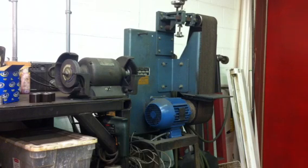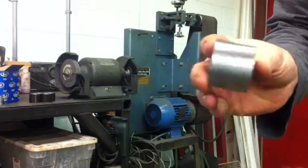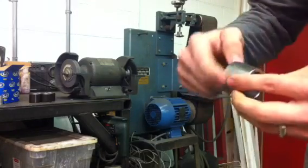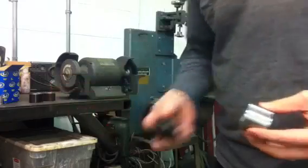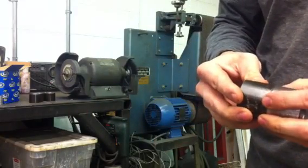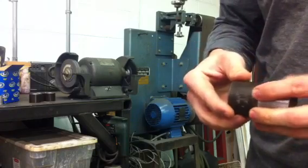Hello, thanks for watching another Welder Series video. Now if you've bought a welded 4-link kit or welded motor mounts or something like that from us, you may have noticed that the tubing eyes have kind of a shiny finish, or that the surface — the OD — has been removed. It's a good idea to do that before you weld it, just to get that scale off of the tubing.